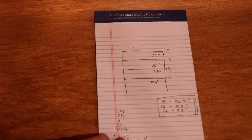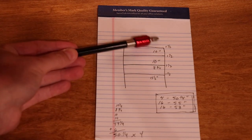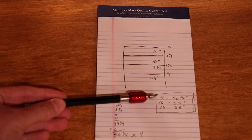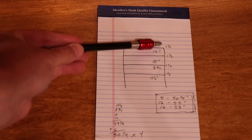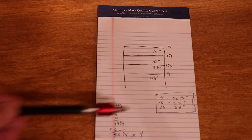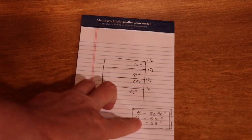In my second highly sophisticated drawing, I added in the inch and a half per shelf, which told me I needed four shelves, and adding those up plus four times one and a half gave me 50 and a quarter inches for my leg height. I didn't make mine quite symmetrical though.